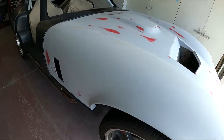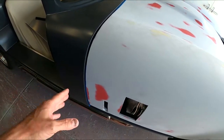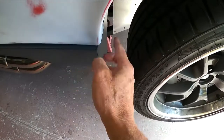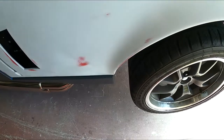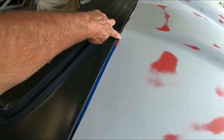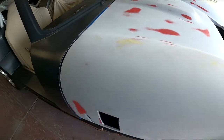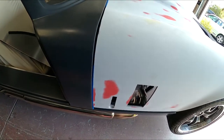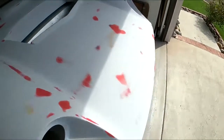The nose is on, just sitting here, not bolted down. I've taped off where I need to move this thing backward because this edge should line up with the pontoons - I'm about a quarter of an inch proud on the nose. So this thing has to be moved back. I've run a tape line and measured that quarter inch. The other side is even a little bit worse - I'm going to grind that off.